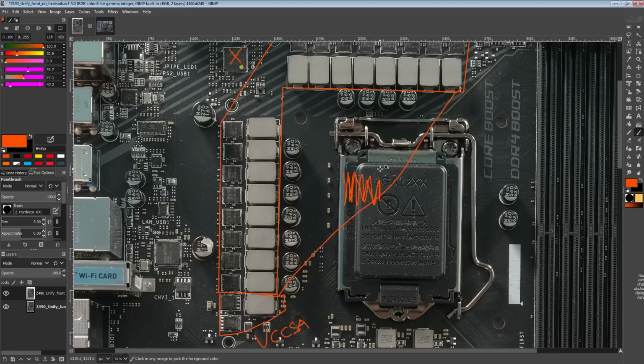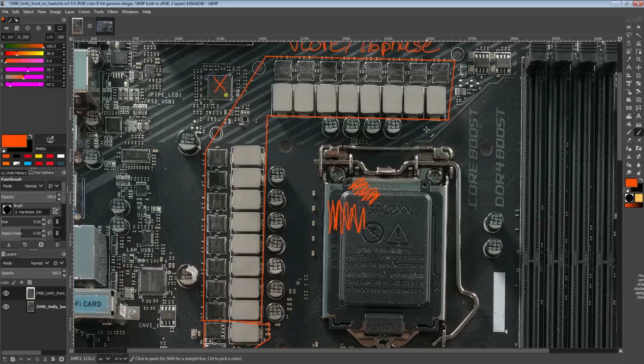Whereas if you have an iGPU phase, if I'm not mistaken, the iGPU power pins are right around there. So if this right here were the iGPU, then you'd have a power plane that goes like that, and your VCore would have to go around this right here. That basically just means you have more power plane impedance, because any power trying to get into the CPU has to go around instead of just being able to go directly from wherever it comes from into the power pins.